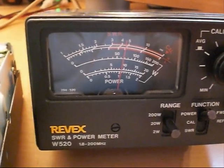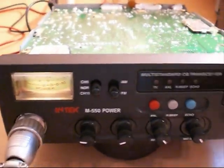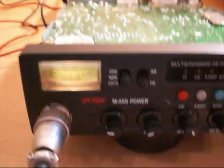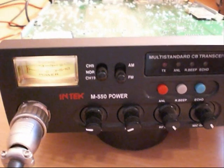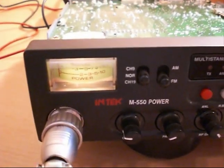What I'm going to do now is turn it over, remove that cap completely, and then tweak the coils — the inductors on the output stage. They're not tunable ones, but just by a little bit of stretching or compressing you can normally get one or two extra watts out of them. Sometimes it works and sometimes it doesn't, but we'll see just how much we can get out of it.